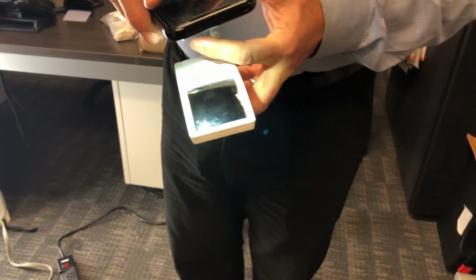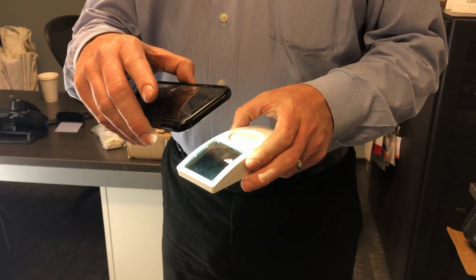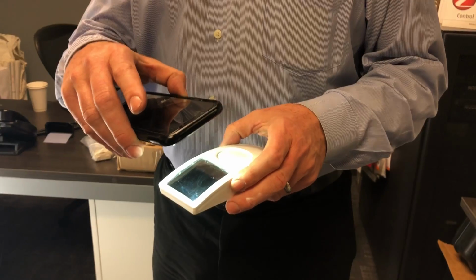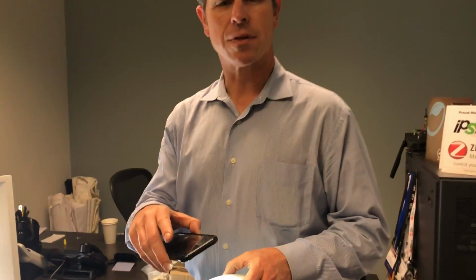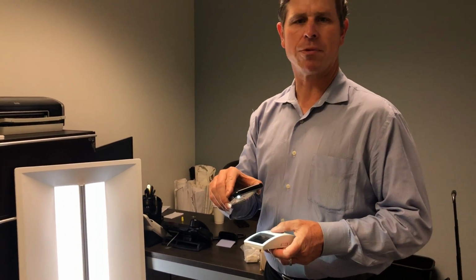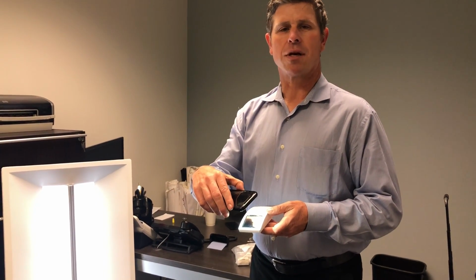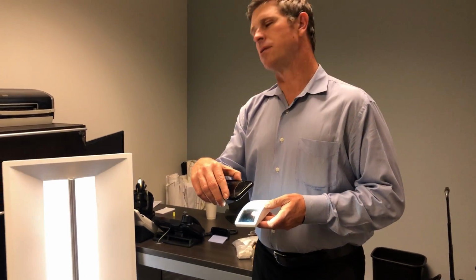But the way the algorithm works is based on some technology studies that Rensselaer Polytechnic did in New York that said if you adjust the light levels over a period of 7 minutes, it takes advantage of the workings of the human iris, and so the occupants won't recognize what's happening. Effectively what we're doing is a slow change. So even if you have a cloudy day where natural daylight is bright and dimming and bright, it won't cause the light levels in the space to fluctuate to the point where people recognize that. But for the demo, we're driving this with a lot of light just to get across the idea that one way to turn off the lights is to use the daylight harvester.